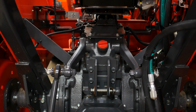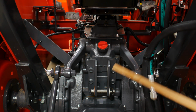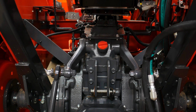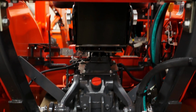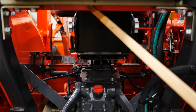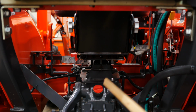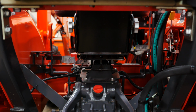So let's get started. Okay folks, at the back of the tractor, we're going to take the top cylinder and hook it into the top set of eyelets here, and that'll let the cylinder kind of hang in this position. If you were able to look up underneath the toolbox that we installed, great video if you haven't seen it already, there's a 10mm hole here, and behind that hole is a spot-welded 10mm nut. So we're going to take one of the steel S-hooks and connect the chain, and that chain will just come down and loop, connecting to itself to hold the top cylinder in place. When the cylinder isn't there, we'll be able to connect the chain to itself in such an orientation that it won't interfere with the lift arms of the 3-point hitch or the PTO shaft at the bottom. So hang on, we'll be right back.